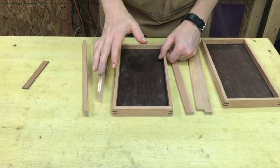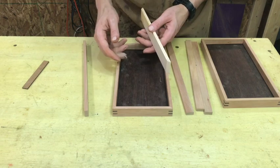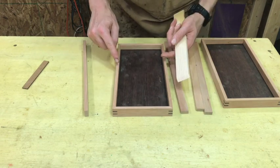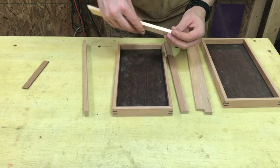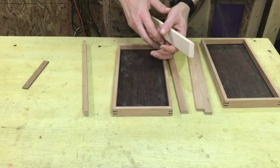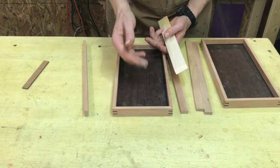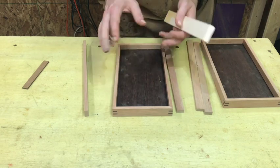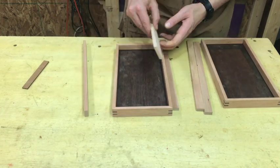Now at the beginning of the video, if I remembered to mention this in the intro, there's also the other way of doing jewelry boxes where you put a groove pre-done into these wall border pieces here, in which case everything just slides in. I chose not to go with that for this one. I think it's just a little simpler to go through and do the dividers individually, but I may make a future video, or there are probably other videos, in which case it's much simpler when you get to this part. You already know your exact width across, and you can just proceed that way.